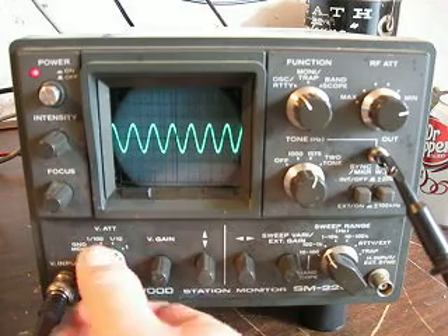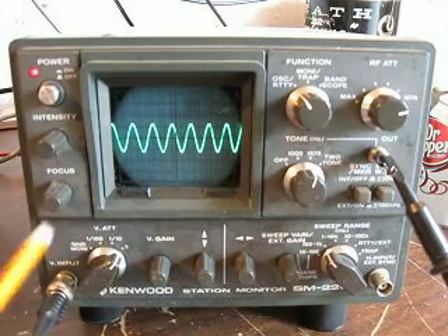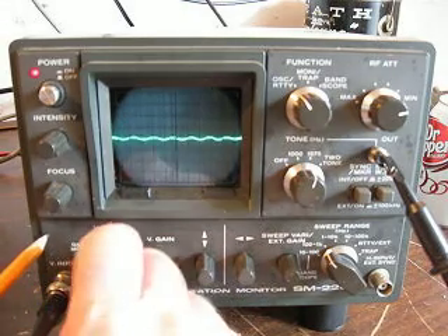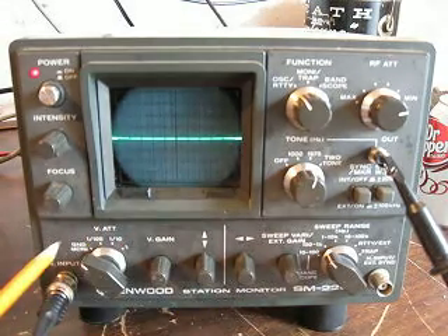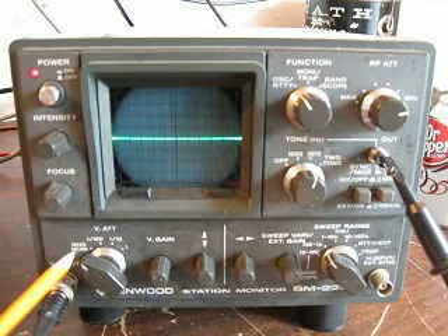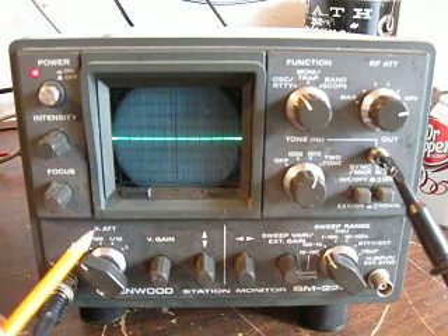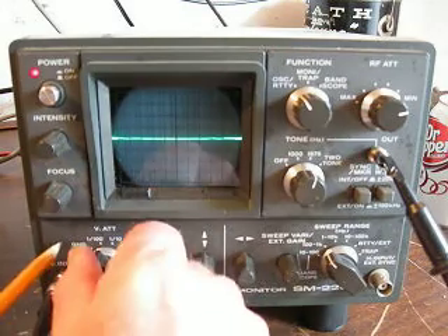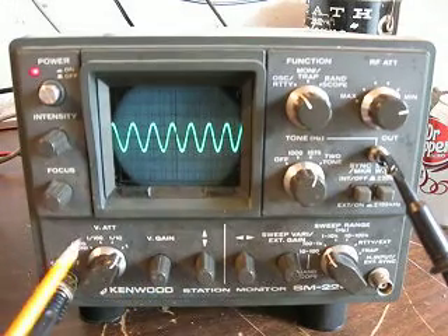You can see it go all the way down there. We'll push-pull it back up and it's back to one again. If you go to ground monitor — let's flip it over to ground monitor — you can see now that it is grounded out. The vertical trace is grounded out; what we're doing is shutting down the vertical input stage when we go to ground monitor.